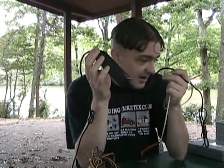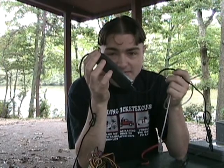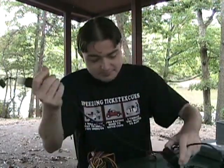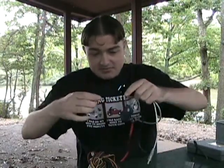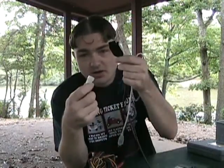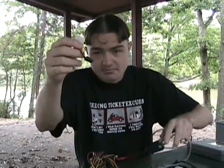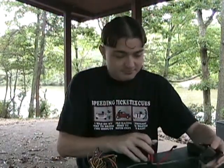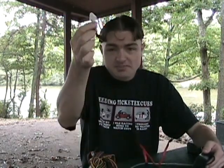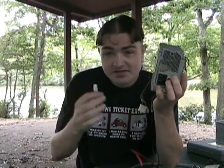But I'm using the power supply because it's one wire I have to hook up, and it's a much cleaner, better source of power. But if you're salvaging, it comes with this little adapter so you can go from a parallel ATA hard drive to a serial ATA power adapter. Now if you get this adapter kit and you decide to go with the computer power supply like I am, just pull this off, because you're probably using an old salvaged power supply that doesn't have serial ATA plugs.